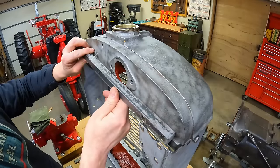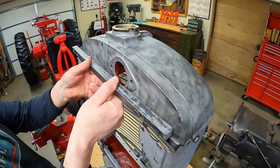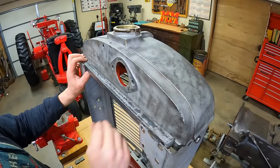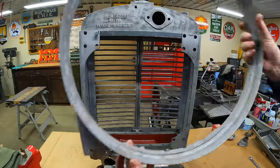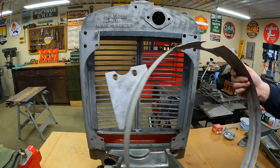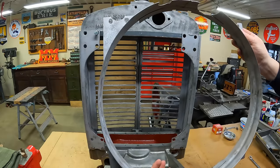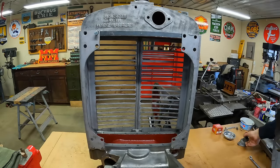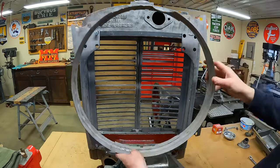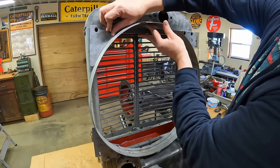Here's the spacer bar we discussed earlier, because this production ZB top tank was made to work in conjunction with everything else that was deeper this way. The quickest way to do it is just a heavy steel bar to fill the void — and it's a nice fit too. And finally, our modified production ZB fan shroud. The main modification is this opening they cut right there, because in a ZB this fan shroud was attached right against the back of the radiator top tank. But because we've got these deeper side panels and the spacer bar, it brings the fan shroud to the rear just enough that they needed extra clearance where the upper radiator hose angles down a bit — otherwise the top edge of the shroud would have been into that hose. Once again, correct Rockford bolts; there won't be a single bolt on this whole assembly that isn't a Rockford by the time I'm through.